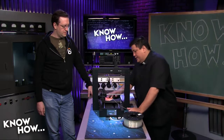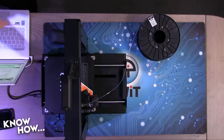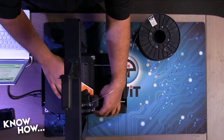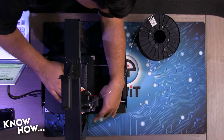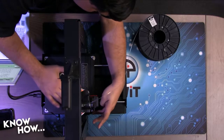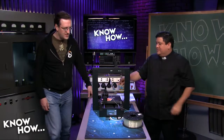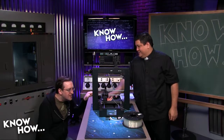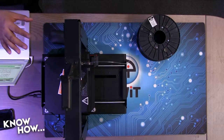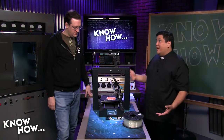I'm going to go ahead and move to the next position. It's going to go to a corner, coming in from the outside, but it wants to be closer to the center because that's where most prints take place. I'm going to give it a bit more tension — wow, this bed is way off. I've actually run out of room on the bed; that screw is all the way loosened and it's still not touching. This has been a problem with the Plus version — on two separate printers the carriage underneath is actually bent a little bit. You either have to send the whole thing back, or I've got a different kind of fix.